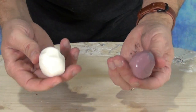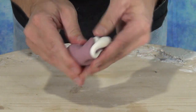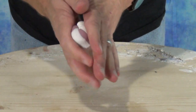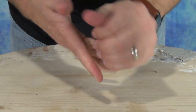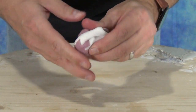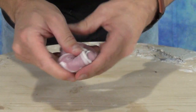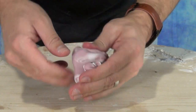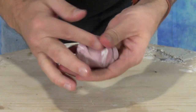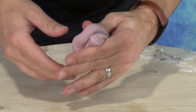This has a working time of around five minutes at around 75 to 80 degrees, so you have plenty of time to mix it together. I usually do this without gloves, but if you do wear gloves make sure they are not latex — use either nitrile or vinyl gloves. You're just going to knead the two materials together until it forms one uniform purple color.